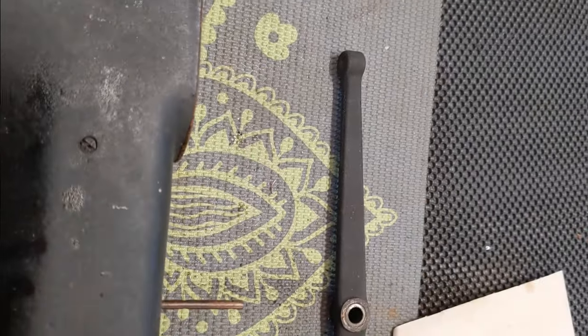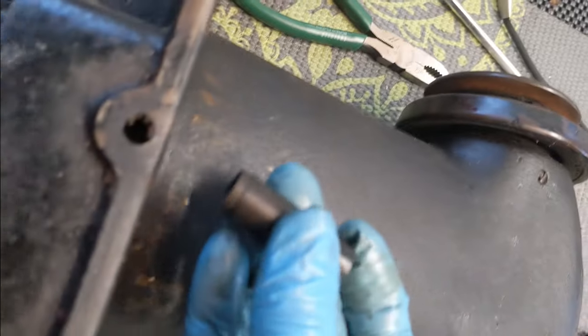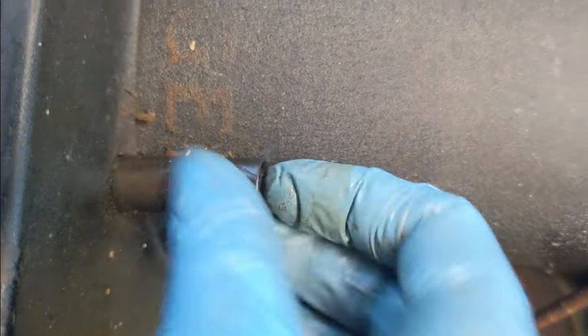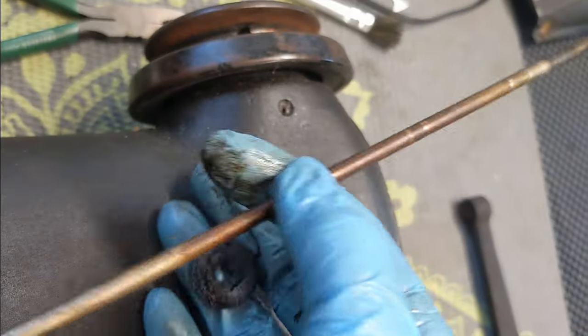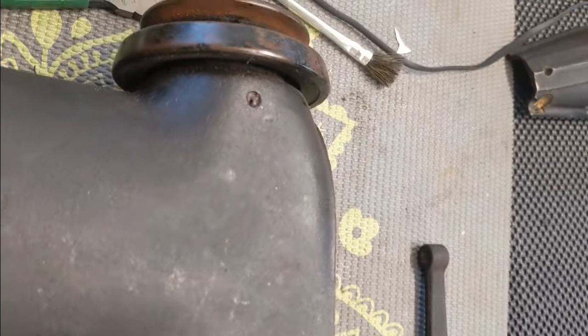So here's this part — obviously this is the little brass shaft. And when this came out, there was a little bushing down here that popped out also, which probably sets in this hole here. There was what looks like a felt washer down below here, and right in there is where the hole is. I'm thinking that the little wide part of this was coming up against the washer down below. So I think I'll just create a new felt washer — I'll cut a piece and make it work. But since I took this out, now I have access to this screw. I'm going to go ahead and take this out because that's this other plate here that I can pull out so I can clean inside the nose a little better.